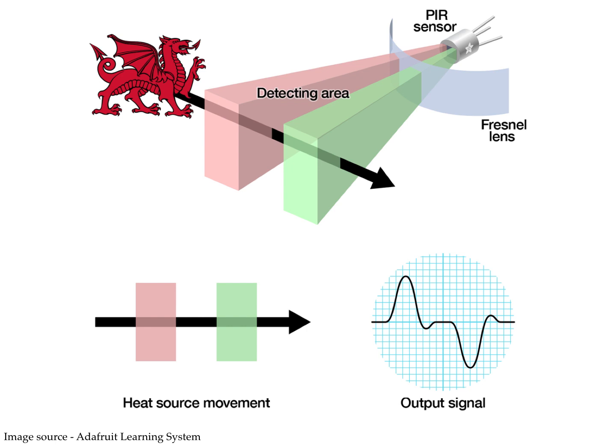This project depends on the PIR sensor to wake it up when it's time to take a picture. This illustration shows how PIRs detect movement within a narrow temperature range corresponding to the body temperature of the average mammal — or dragon, apparently. This is why I call the project the MammalCam. PIRs consume very little power, but they aren't suited for use in circumstances where the background temperature is close to body temperature. Keep this in mind when you mount the PIR — try to select a location where the background of the scene is cool. Otherwise, the PIR will signal lots of false positives.